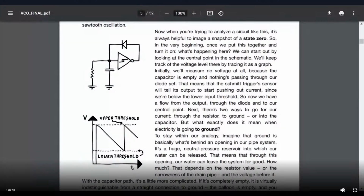It's a clever little piece of circuitry which does all that by itself without us having to think about it. So that turns off the tap, so there's no longer stuff going through here, and all the current is in the capacitor. The capacitor, with nothing coming into it anymore, can let the whole stuff back out again, can discharge. And because of the resistor, it's actually quite hard to do, so it doesn't dissipate anywhere near as quickly as it came in. And that is going to give us this graph where we have this more or less instantaneous voltage rise as the capacitor is filled, and then the slow release as all that current pours out of the capacitor back to zero. And that gives us our flipping sawtooth. Look at that.